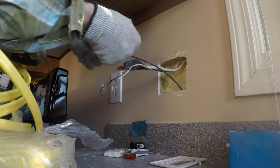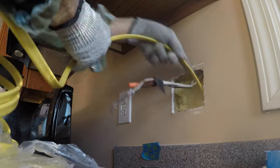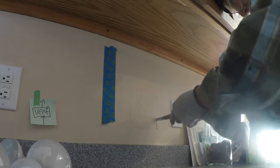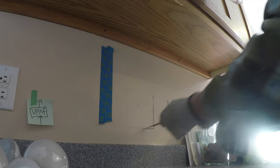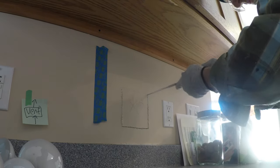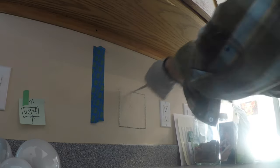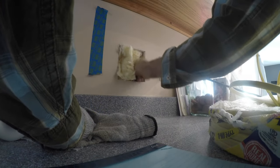In this kitchen, there are four different locations for these under cabinet lights. One of them is by the switch and the others are far from the switch. In every location, you've got to be careful about where you start cutting into your wall. This blue tape marks a stud, and I've got a post-it note on the wall reminding myself that there's a plumbing vent there. So there are some no-go areas. In this case, I had to run the wire a little bit off center on the cabinet, but I run it back to the center when I install the light so it's nicely centered.